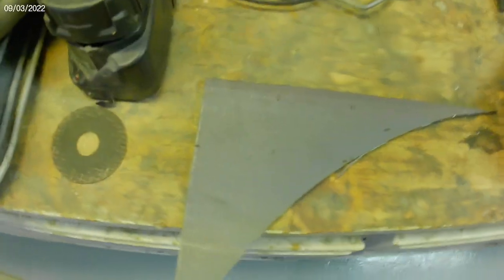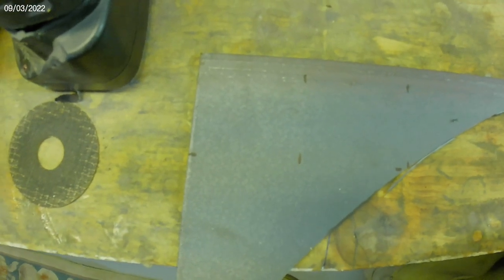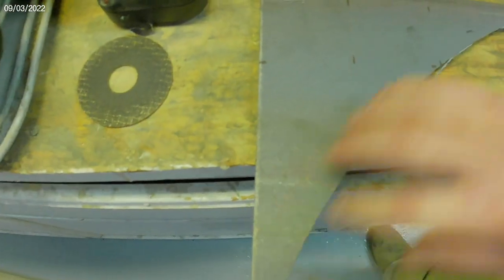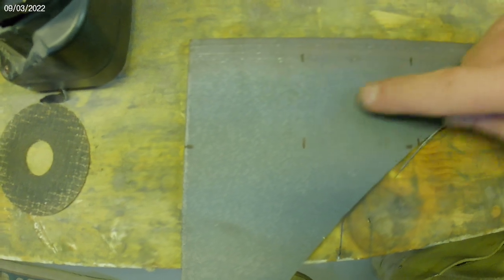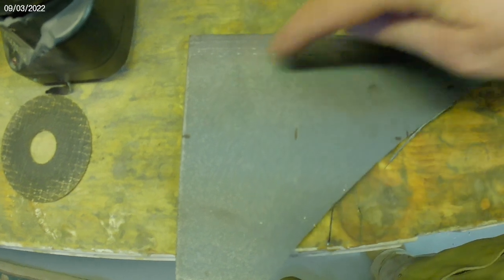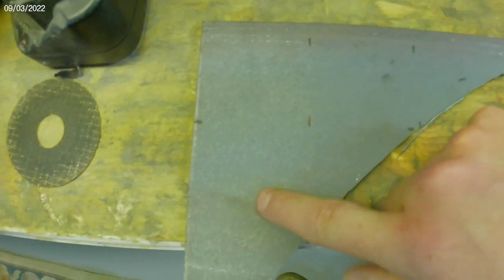One of the things I wanted to see was whether to put the caps totally on the outside or on the inside. Since I cut these pretty much exactly to length, I'm going to need to put them on the inside. The end caps are two-and-a-half-inch squares. I've got this piece of scrap that's also a quarter inch, and I've marked out my squares here — I should be able to get three out of this one.